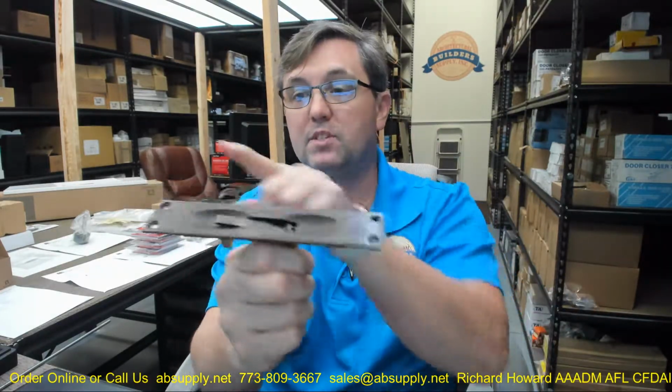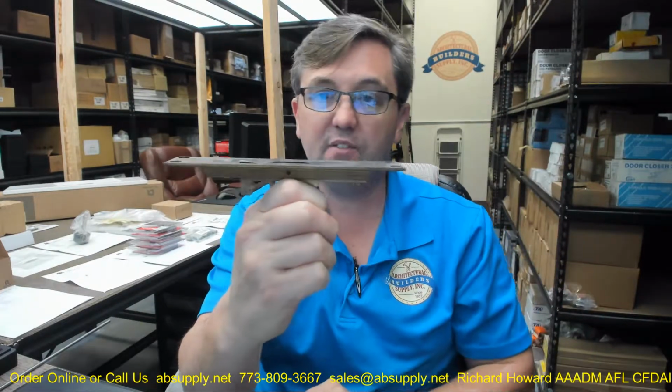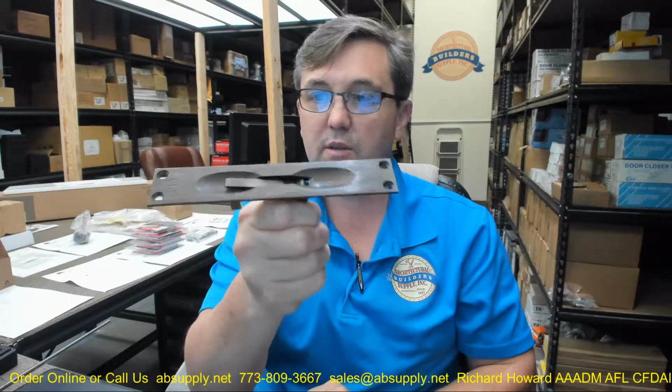Then your plate prep is going to be 6 3/4 by 1 1/4, then the thickness of the faceplate, which they've got at 1/8 of an inch. Okay, so that's how I would go, but that's how I have always gone about doing it. So that template will give you all the rest of the dimensional properties. But again, they're really intended for hollow metal doors. You've got a hollow metal door and you're going to make this sort of preparation.